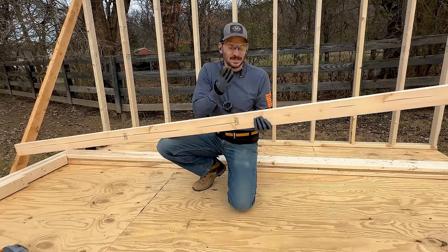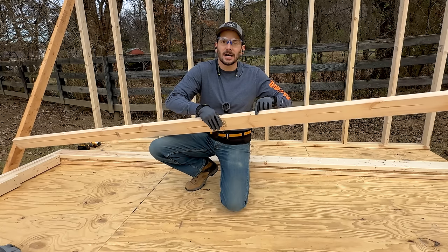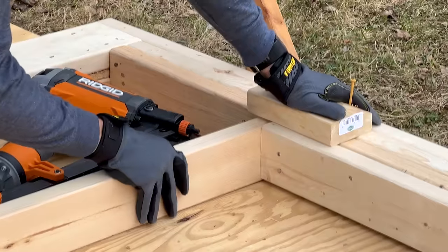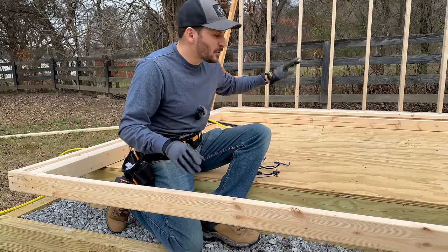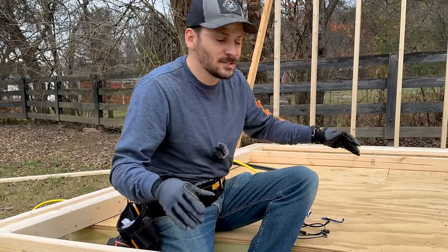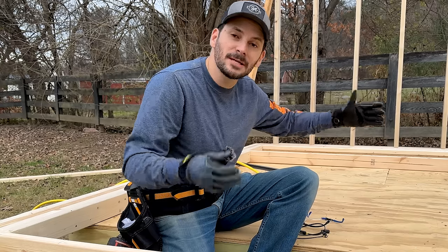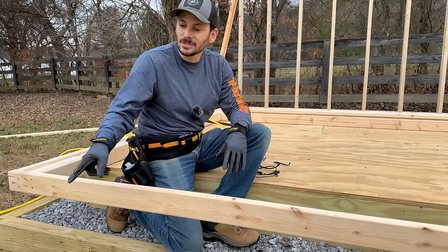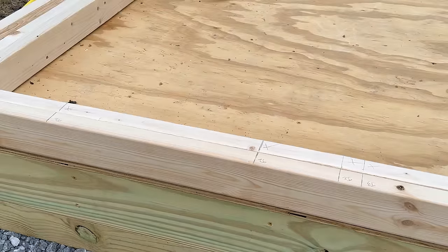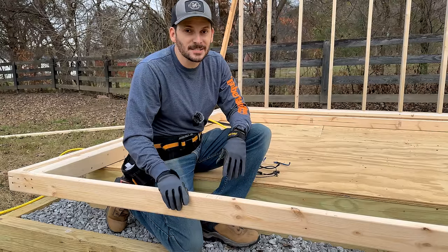With the 2x6s cut to size and the little OSB pieces cut, I can make a 2x6-and-OSB sandwich that comes right to three and a half inches. I can now fill in the next pieces — the header for the door goes right underneath here, and the top of this section will be a double top plate defining the window opening at the top. Before putting on that second top plate, I need to transfer the stud locations using a story stick so I can nail through one top plate easily. A story stick makes it much easier than measuring, since things tend to get a little off as you stack all the studs.